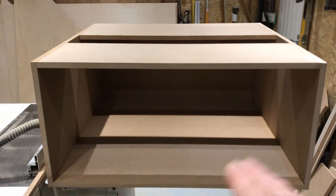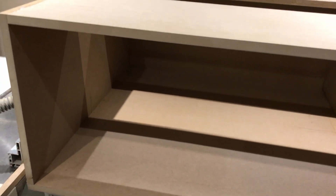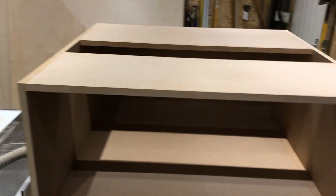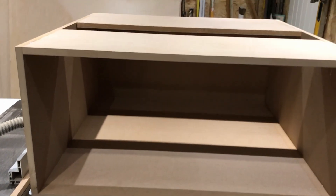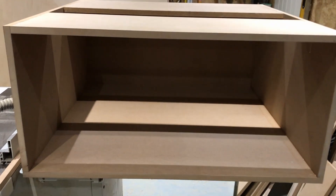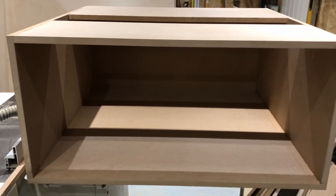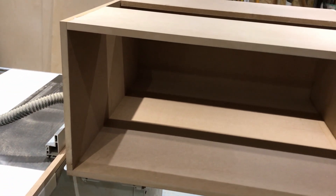I've already made one of the boxes — I'll show you that; it's probably easier to explain. You've got two of these boxes sitting side by side, three drawers inside each, a plinth underneath, and then a bed top that goes on top with the mattress above. They're set up off the ground on a 30mm plinth just to level them up, so the bed ends up about 500mm high, which is not bad for a bed.